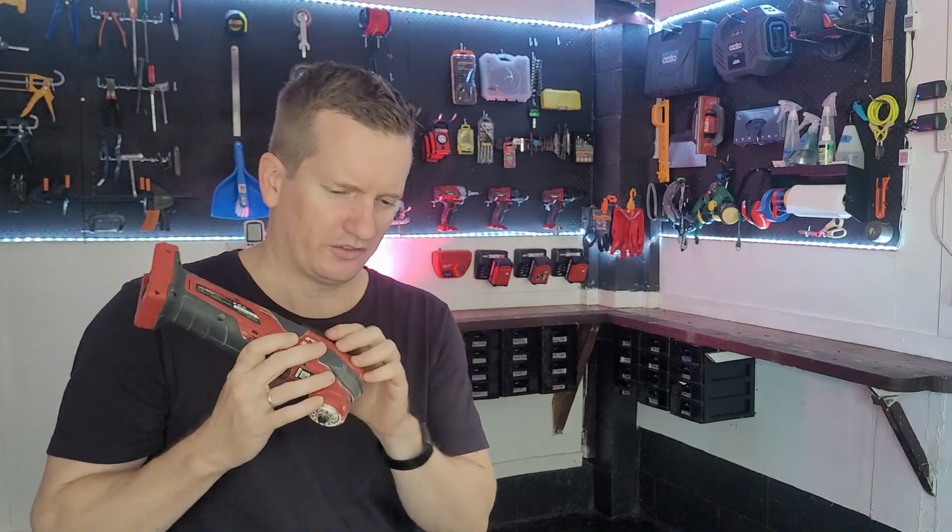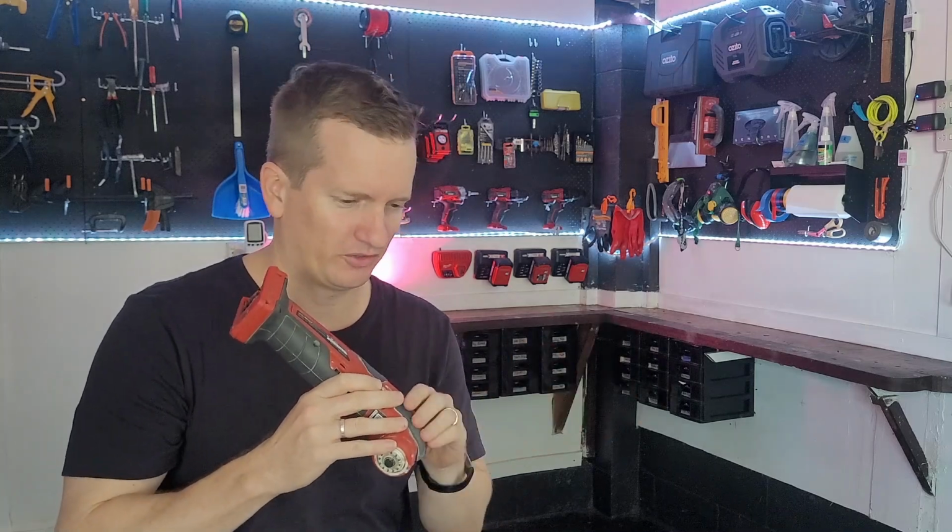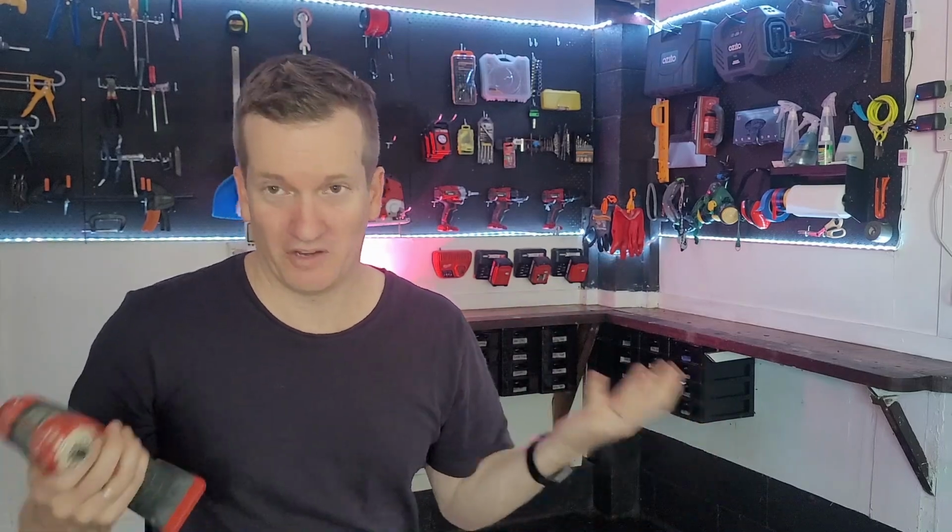And what about the downside of cutting too fast? Well, the downside is that you may lose control, where you'll be happily cutting along, then suddenly you come across a bit of soft material, and then you just slide right along, and you lose all direction and control, and it may result in a very messy looking end product.